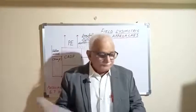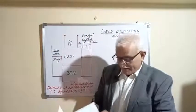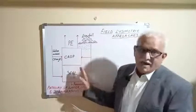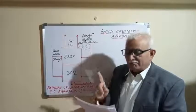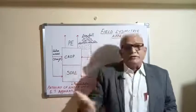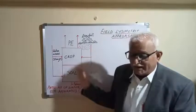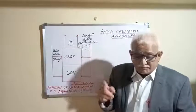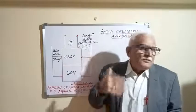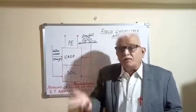Please see the diagram here. Lysimeters have been used extensively in the past to provide baseline information — please note that. Baseline information is provided by lysimeters for eddy correlation techniques, energy balance techniques, empirical formulae, and field lysimeters. This baseline information supports the development, calibration, and validation of ETO and transpiration methods. There are various types of lysimeters: drainage type, weighing type, and now electronic lysimeters.